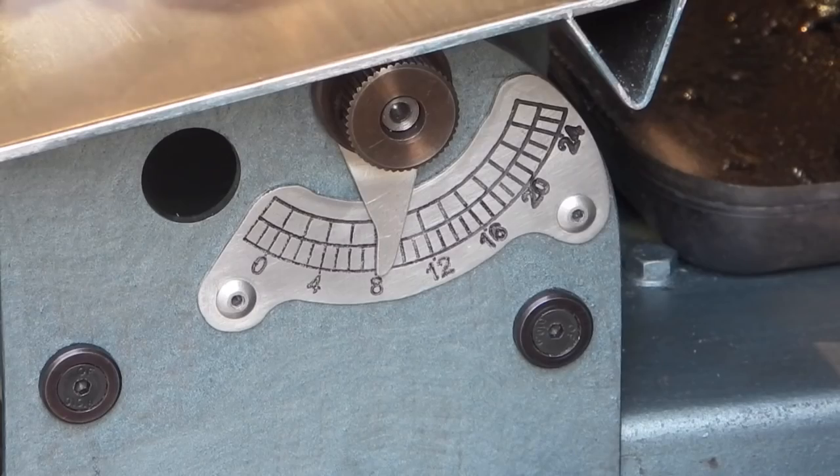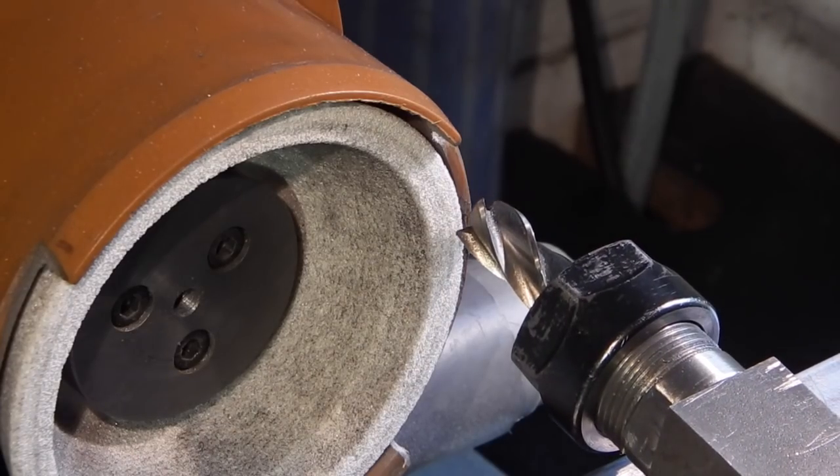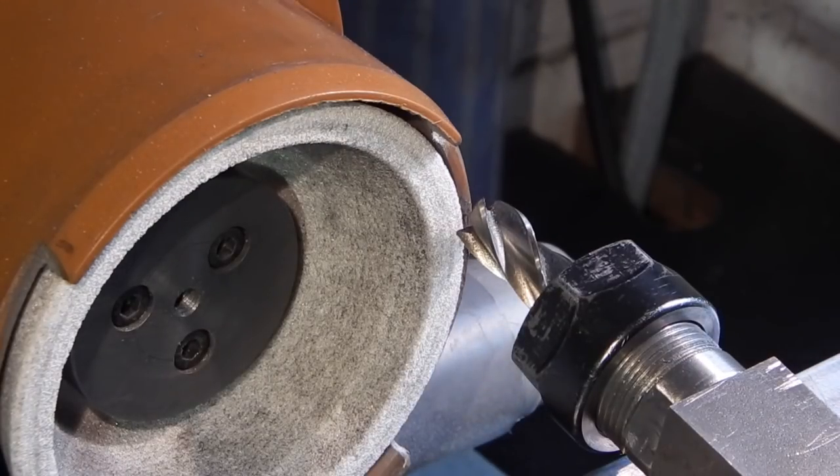You can see I've just taken a cut on there. I've adjusted the table angle to eight degrees, and because the angle changed I have to feed the table in a bit further.